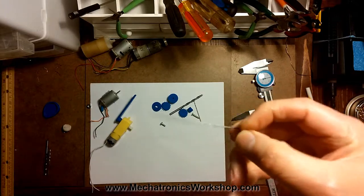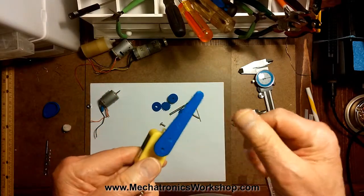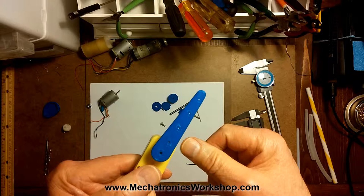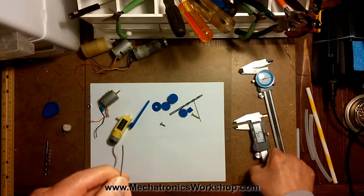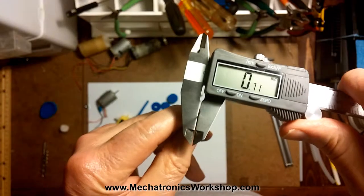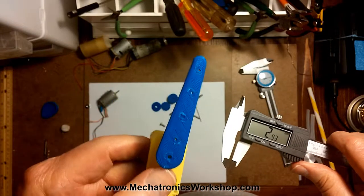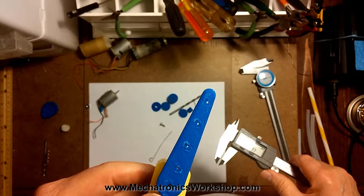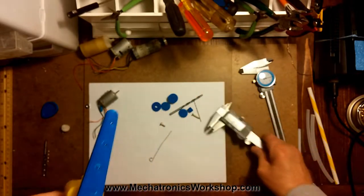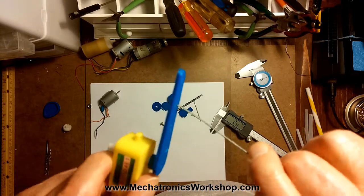Another way to use this: I often use connecting wires to connect stuff. If I want to use this wire in this arm, I need to know how big to make these holes. I use my caliper, make sure it's zero, and I measure the connecting wire — and I see that it's 0.7 millimeters. Then I can design these holes to be big enough to take a 0.7 millimeter wire. I had the CAD program run these at one millimeter and printed them out at one millimeter — worked out just great. So for a 0.7 millimeter wire, a one millimeter hole works out just fine.